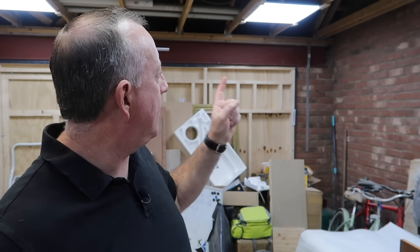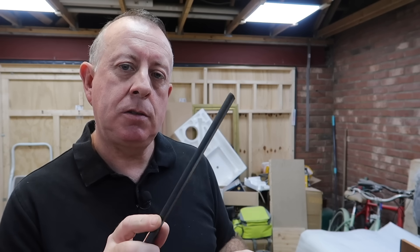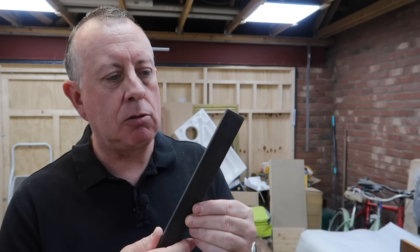Before trying to drill 20mm deep holes in a beam like that, especially upside down, I think it's best that we first look at the two main principles for successfully drilling into steel. I'm going to be demonstrating that by drilling a hole through this piece of mild steel. Now mild steel, or low carbon steel as it's commonly called, is probably the most popular in the construction industry.